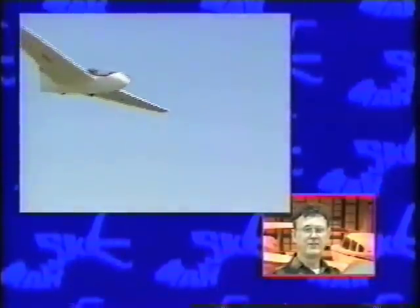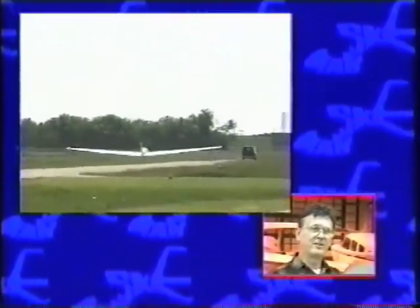So I invite them to take a short hop in the glider on an auto tow — just go up to five or six feet and hang on there for it. Fly along for about 500 to a thousand feet, then pull the release and glide in. This gives you some confidence in it. And that really turns everything around — they'll say it flies just like any other airplane. From there I might give them another tow a little bit higher to get them more familiar with it and feel more comfortable.